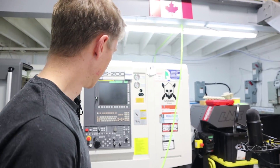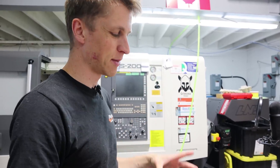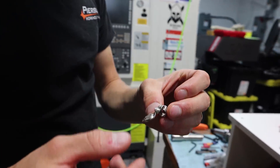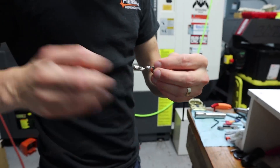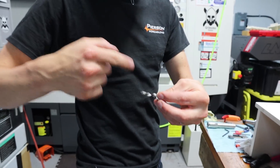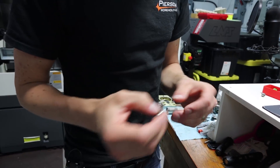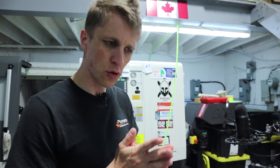I am using all six axes while making the clips, but not simultaneously — the spindles are synced, B comes in, and then you have X, Y, Z on top of that. The lathe is a mind-bender with all six things needing to be perfect. This happened when one of the C axes had a home command before it was unclamped — it clamped here and homing C rotated it to zero before it unclamped, twisting the part. Luckily no damage except for the clip. I've worked out most of the kinks during the first batch.